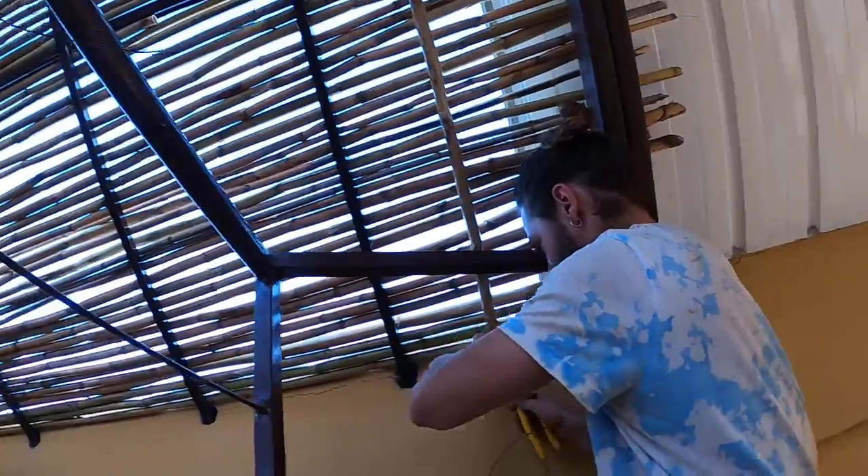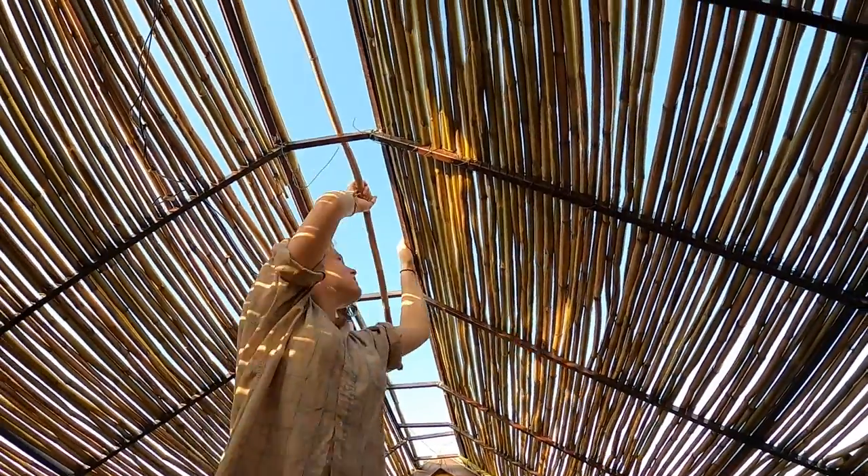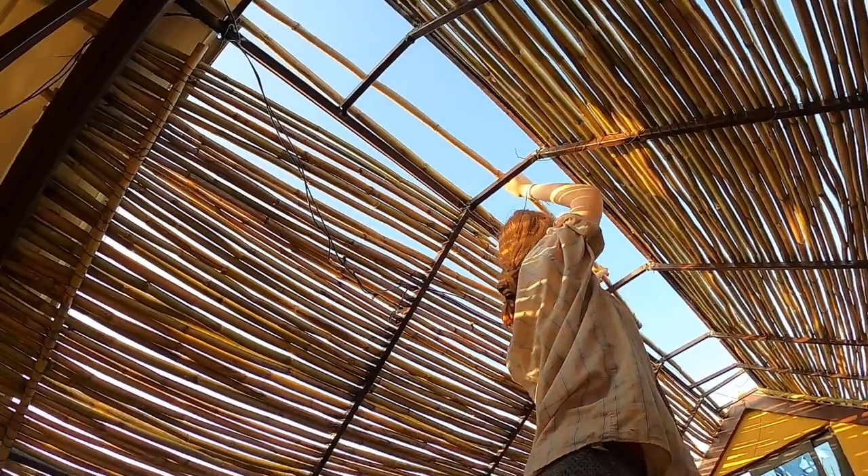All right, we've got the A-crew on it — Niko's doing the sewing, Millie's putting up the last of the bamboo. What we're going to try and do is fill in the spaces with some short pieces. Putting a nice tight weave on it is a nice trick — putting a piece of bamboo underneath to tie it together helps control the spacing, keeps it all level, and actually strengthens it.